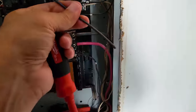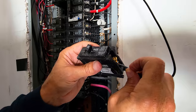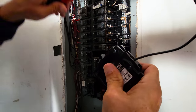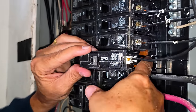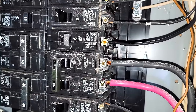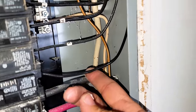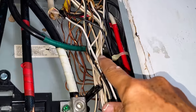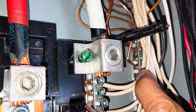All we have to do now is the black wire — our power wire. It goes right in there. I cut the insulation so no bare copper wire is sticking out, because you don't want anyone inadvertently touching it later. Make that nice and snug. Now we're ready to insert the breaker: hook goes behind the tab, put it all the way down in there, then push it into place. We are now installed. Check the wiring and make sure everything is routed properly — black wire runs straight up tucked in with the others, white wire comes down to the neutral bus, and the copper ground wire runs down to the ground bus. All three are in place.